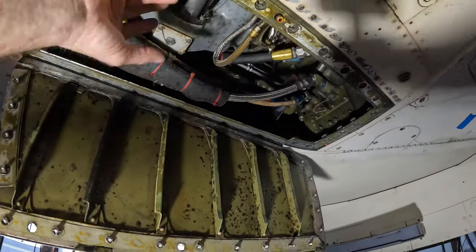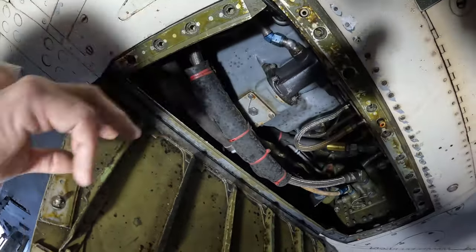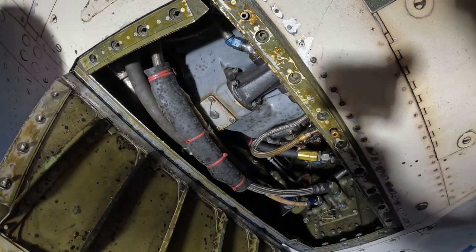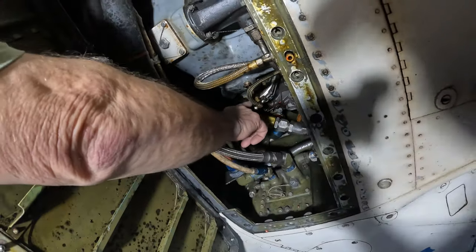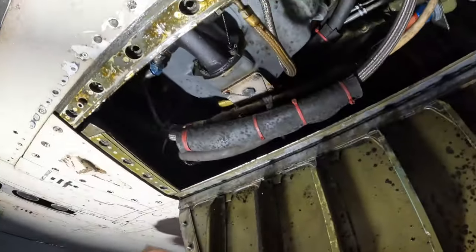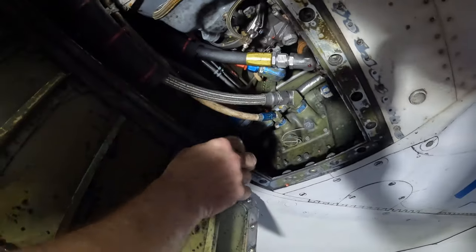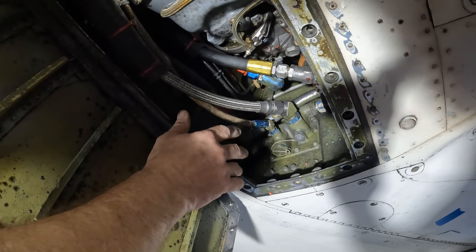This is the very front bottom of the engine — this is your accessory gear drive case. It drives both the hydraulic pumps and fuel pump, and the starter is engaged into the gearbox. Right here you can see the bottom of the right hydraulic pump, and the left one is over on this side, just sitting up there like a V. These are the quick disconnects — these pumps are actually pretty easy and quick to get in and out.